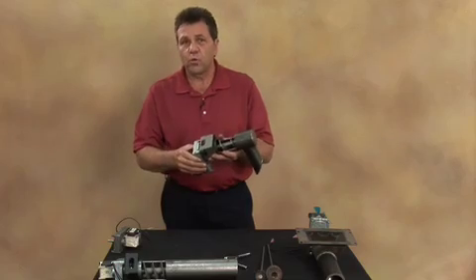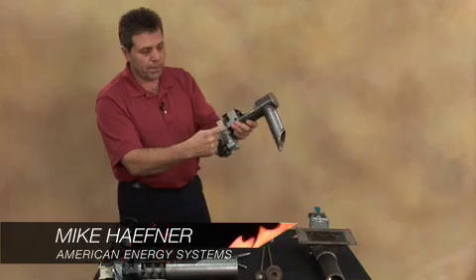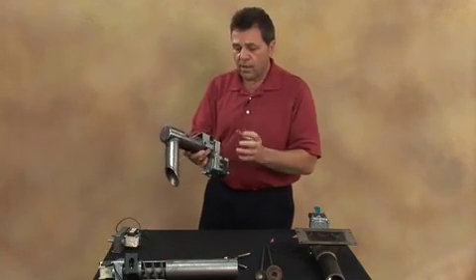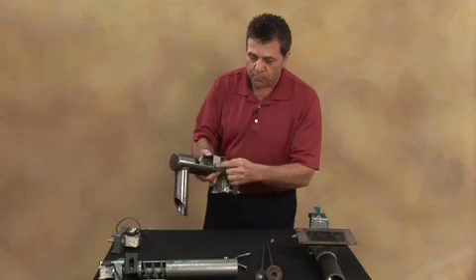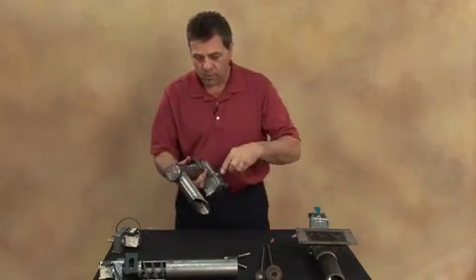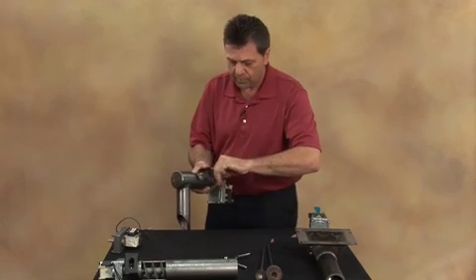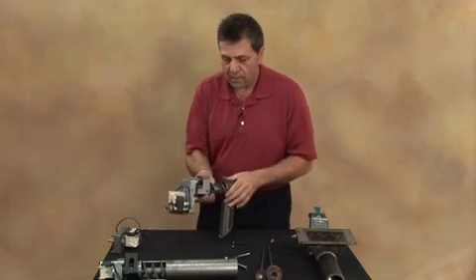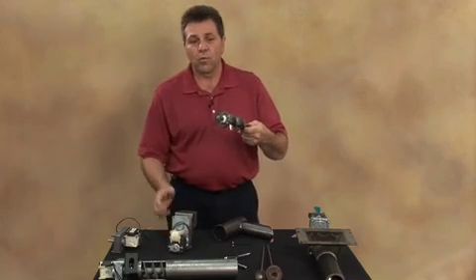If there's an instance where you have to take this auger system apart, there are actually two ways to do it. The hardest way is to go ahead — there's four bolts, two on each side, that you would take off with a small ratchet wrench and the whole auger motor slips off. The easy way, and the way that we recommend, is there's a bolt on each side of the auger system — just simply loosen those two bolts and take them off, and now the whole entire auger system including the auger flighting will come out.